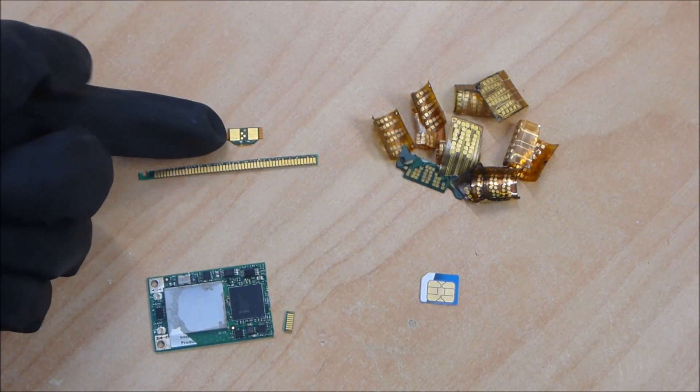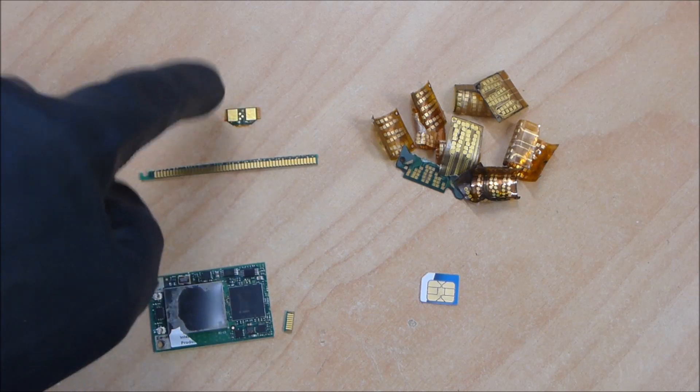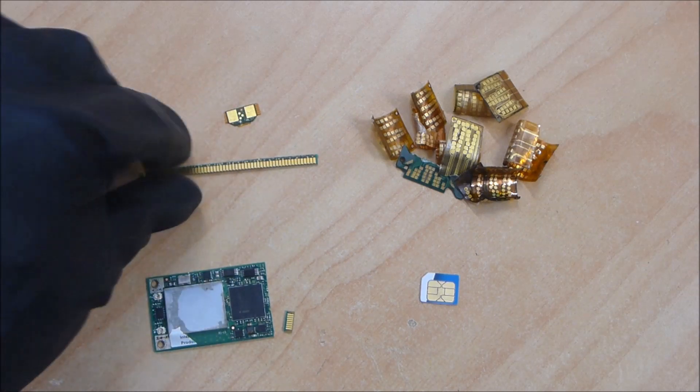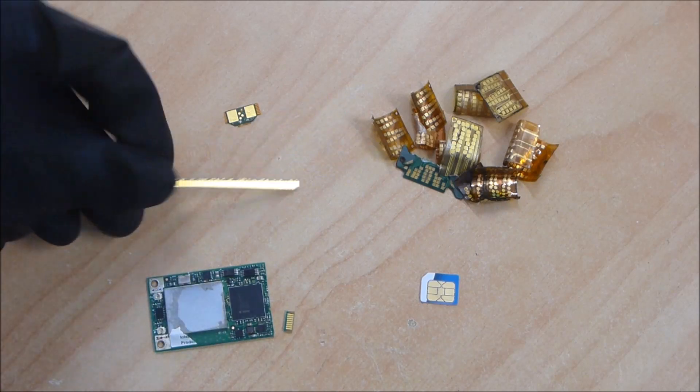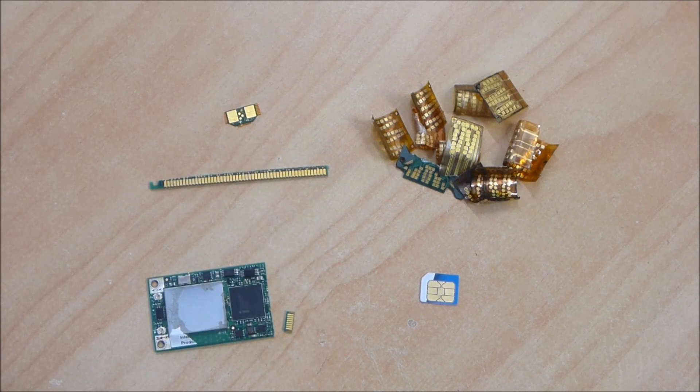For our controls, I have an ENIG board — electroless nickel immersion gold — and I know that's what it is because that's what it was ordered as. I also have a randomly picked RAM finger, which can generally be assumed to be a decent quality hard gold plating. I'll get all this set up under the microscope and use one drop of 35% nitric acid on each, then see the short-term reaction as well as how the gold looks after about 15 minutes.